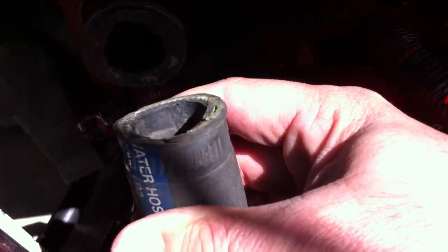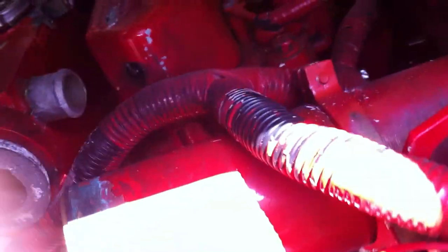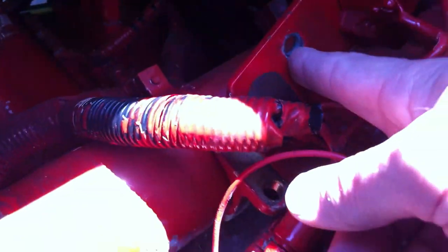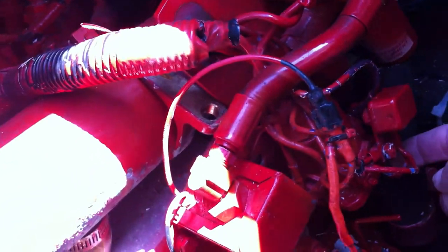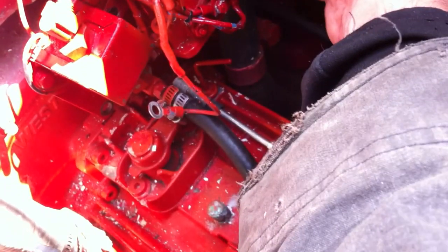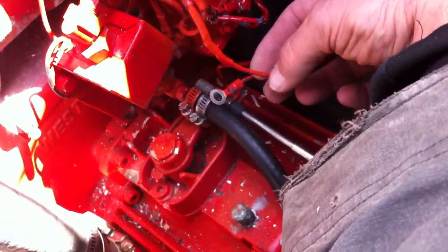What we're doing today is taking a heat exchanger out. The first thing we had to do is take the exhaust elbow out. This is the water going into the exhaust elbow right here, and the exhaust elbow hooks up right here on the back of the engine, and here's the heat exchanger. To get the heat exchanger out, you've got to get some bolts off - one right here and one down the bottom. There's one behind this solenoid, so you've got to unhook the solenoid and release the wires. The wires are tie-wrapped here, so I had to undo those. You've got the ground wire for the fuel pump - got to remember to put that back on.